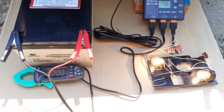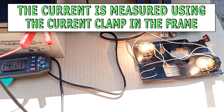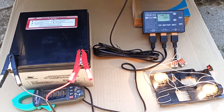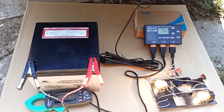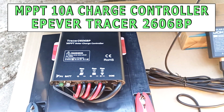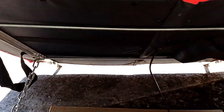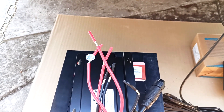When the battery was discharged, the solar panel provided energy to both charge the battery and my load. The combined current to the battery and load was about 5 amps, and the load power was about 60 watt. Now the battery is fully charged and all energy from the solar panel goes to the load. Since this is a PWM controller, excess energy is simply cut off, meaning this controller uses solar panel energy inefficiently. To use solar panel energy more efficiently, MPPT controllers are used — I will talk about that in the next video.